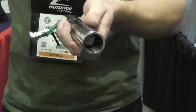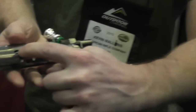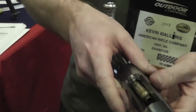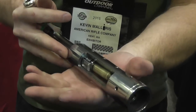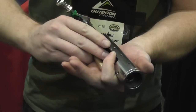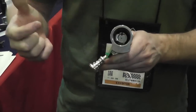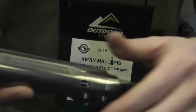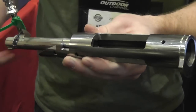Mine does that now, yep. And it also has the Springfield-style ejector, which is an inertially driven rotating piece of hardened steel on a shoulder bolt pivot. So when you draw it back, it cams that steel into a slot in the bolt face. It's up to the user how far you want to fling the brass — you can do it nice and soft or you can hit it hard and send it flying. And unlike a standard Remington bolt where you have the ejector right at the face of the bolt, right at the side of the ground zero of an explosion, this one's all the way back here. There are no springs involved — it literally can only cam into that slot, so it's never going to fail.